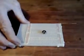This is the 1K pot, so I'm going to put that across the central divide of the breadboard, straddling it. Then I'm going to take the 4148 diode and put it with the black end - the cathode - into the left-hand leg of the 1K pot, and put the other end of the diode into any free row of holes.